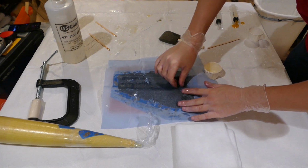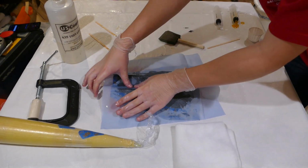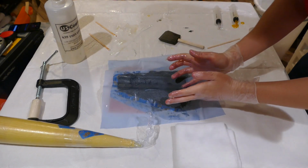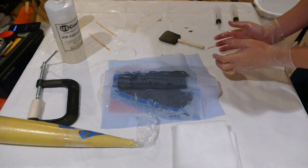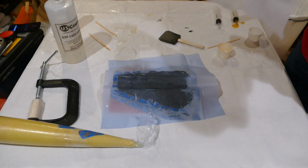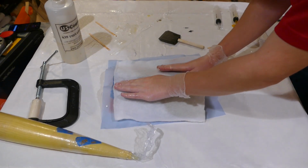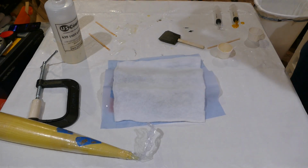You know, I guess I never mentioned why you might want to do this. The advantage of this over traditional methods of creating a fin can is that the biggest advantage is just that you're able to remove a bunch of the unnecessary material that you otherwise don't need, but would take up a bunch of valuable weight in your final part. You could do tip to tip carbon over just a standard airframe, but this is effectively tip to tip carbon without the standard airframe underneath.